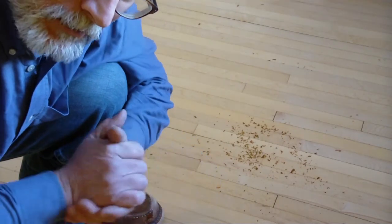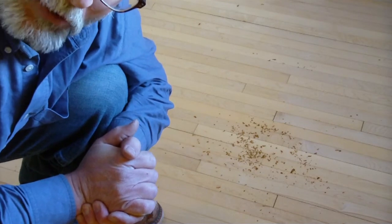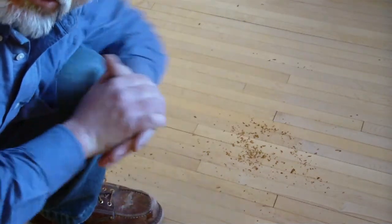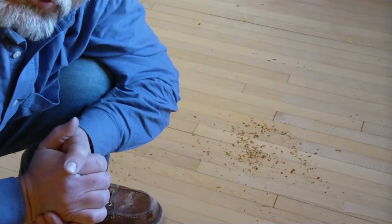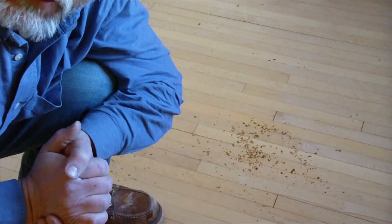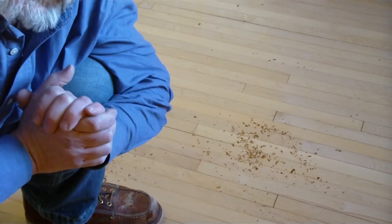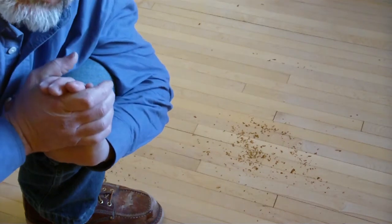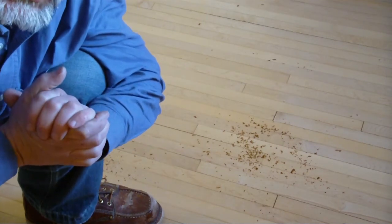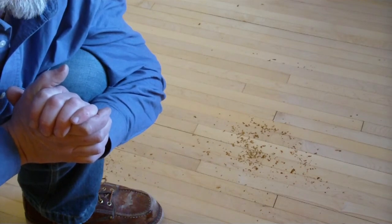A few months ago, I blogged about a henna tattooed wood floor, and I'm back now. The homeowner has scheduled a resand of the floor, and I just thought I would include you in the process. I'm starting out with a 60 grit piece of paper on the drum sander, and you'll want to put on your earplugs.